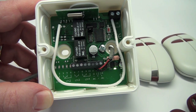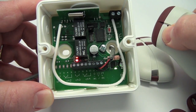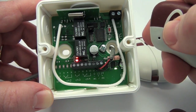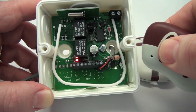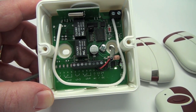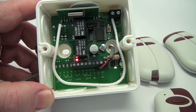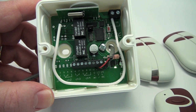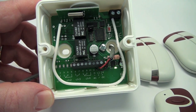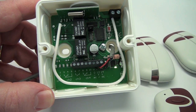If you wish to enroll multiple transmitter buttons at the same time, enter programming mode by pushing the relay programming button for two seconds or until the corresponding LED illuminates, then release the button. Momentarily push the transmitter button of the transmitter you wish to store into memory. After the relay cycles and the LED flashes, you may continue entering transmitters one at a time. With each new transmitter button memorized, the LED will flash and the relay will energize, click on and off. After you have entered all transmitters you wish, the receiver will exit programming mode within approximately four seconds. Be certain to enter each consecutive transmitter before the programming time of four seconds has elapsed.